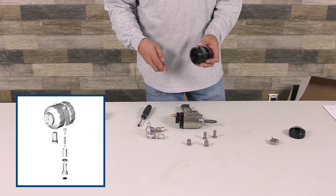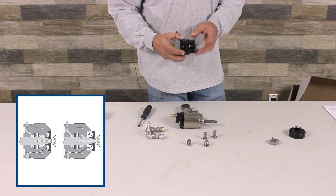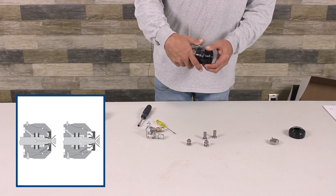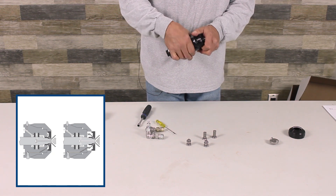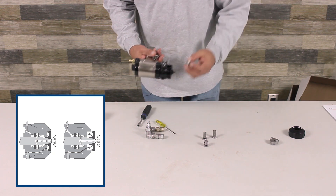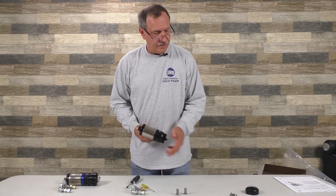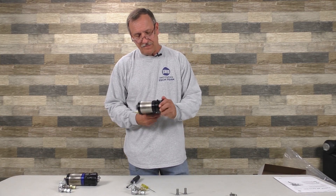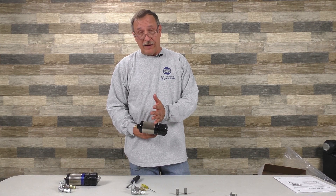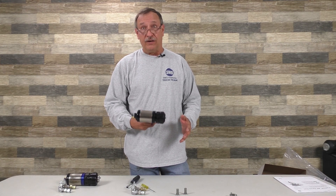This is your fluid housing. The fluid comes up through your check valve and goes at an angle to your side seals — that's what pressurizes it. When you put the gun together, every time you put a piece on, always put air to it. If I had an air tank right here, I would put air to it and trigger it to see if it's working fine. As I'm adding parts, every time I add a part, put the side seal on A and B, put the nose cap on, and trigger it. If it doesn't work right or it's really slow, go back and find out what happened, because it's supposed to be triggering fast. You don't want to pull the trigger and wait a count before it starts spraying.